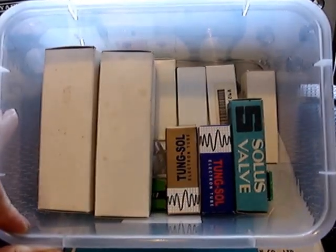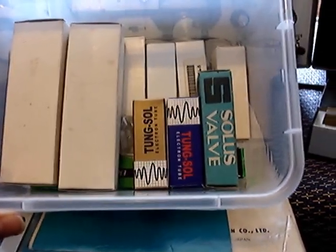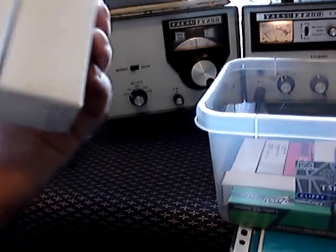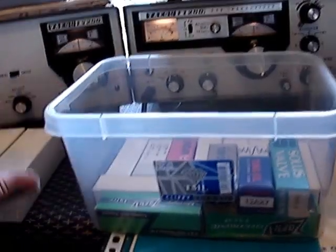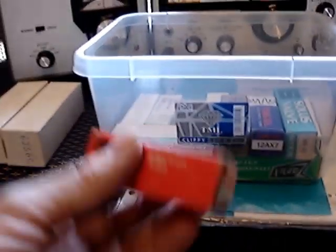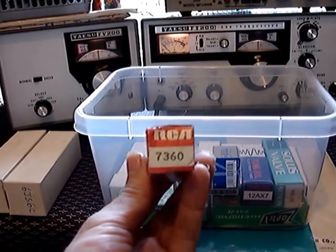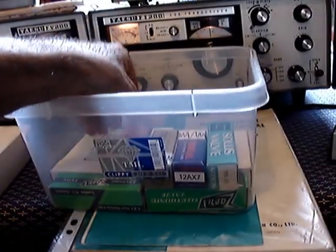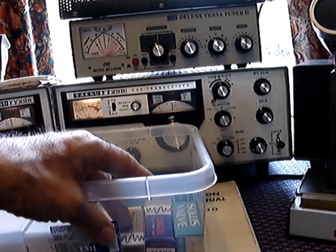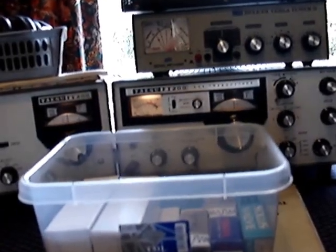It's important to have spare parts. Here we have a complete spare set of valves, including the output valves sourced from the United States — quite rare and hard to get. Most of the small valves are easy to obtain, but the 7360 balance modulator tube — which creates the modulation on sidebands — is virtually impossible to replace when it fails. I have one new one fitted, plus a second-hand one and an older known-working unit.